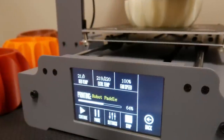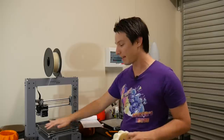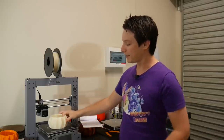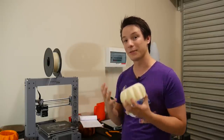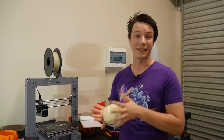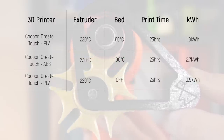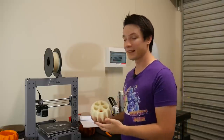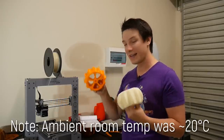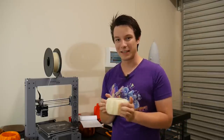I wanted to see how much energy would be used with the heat bed completely disabled. Here's the thing — you don't need a hot heat bed to print PLA. The machine comes with a build surface, and this print stuck beautifully down with no issues and a disabled heat bed sitting at room temperature the whole time. The result was fantastic. The overall energy usage was just 0.9 kilowatt hours — quite a lot of saving compared to running the heat bed for basically identical results. You really don't need to run a heat bed when printing in PLA.